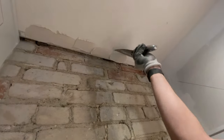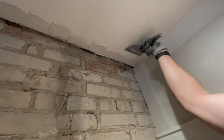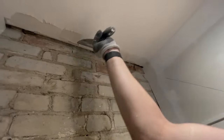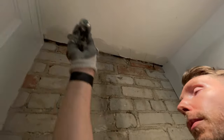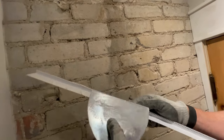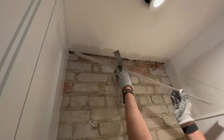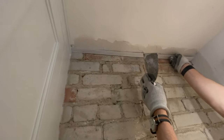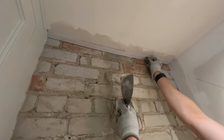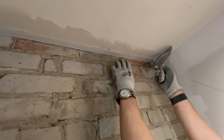I'm just preloading the surface — this is taping mud but you can use your joint compound — and I'm also going to put a bit on the back of the bead to firm that gap up a little bit more. These beads, sometimes you're going to spray some adhesive and staple them, but these are designed just to be mudded in. I'm going to set the bead where I want it, snug it up to the brick, and smooth it in to lock it into place.